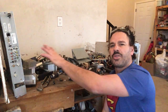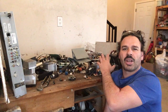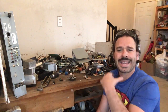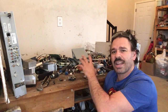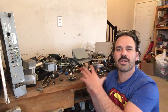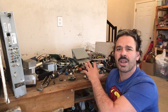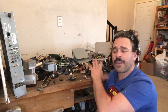Obviously gold on the circuit boards is going to give you your high price. Low-grade circuit boards will just have stuff like copper and aluminum on there. Unfortunately, I only get one price here, so regardless of what's on them, it's about five to six cents a pound. So it is definitely well worth my time and energy to separate the materials and get the clean value price for those metals. These have a lot of copper on them, which is going to be number two copper at four dollars and ten cents a pound, plus some aluminum extrusion.